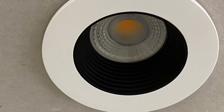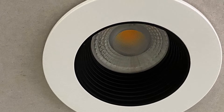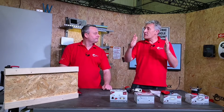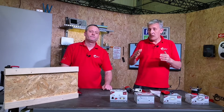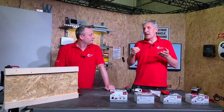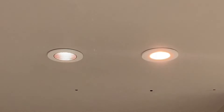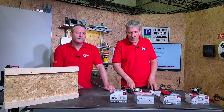The anti-glare downlight is a little bit special — the light source itself is recessed further back from the ceiling. The standard range is 60 degrees; the anti-glare narrows that to 50 degrees. Lighting designers like to hide the light source so you see the effect but not the light itself. You'd use this in a cinema room, a multi-use room with a TV, or above dining tables where you're spotlighting the table. You just don't get that glare — it's a very subtle and impactful difference to a lighting installation.